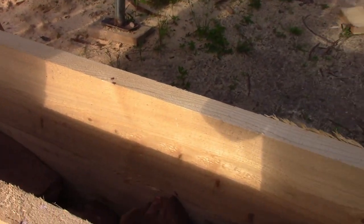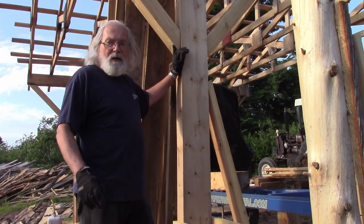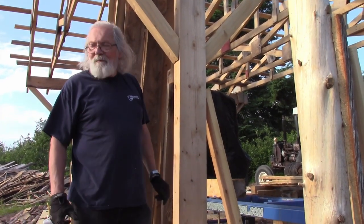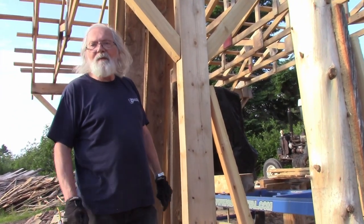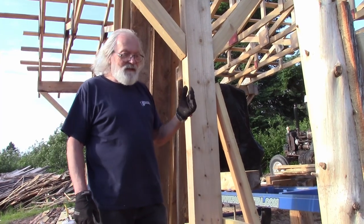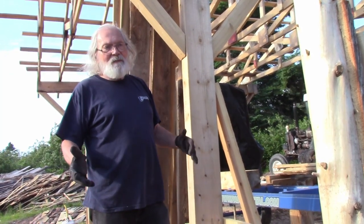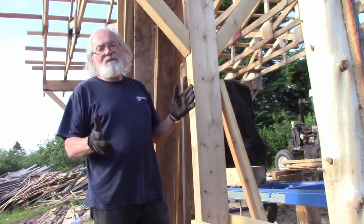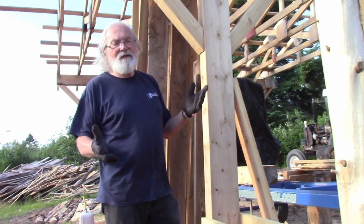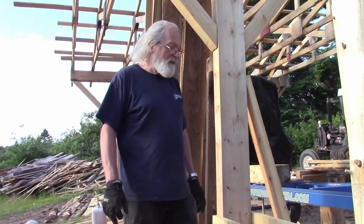And I'll add more, but what I'm doing tonight is I'm going to dump a couple of bags in each wall. Couple bags of what? Of quickcrete. You dump it in and you just water it. Cool. And it won't grow, but it presumably will harden. Sounds good in theory. I've never used it before, and it's more designed for post holes and things like that. So this is a slightly different application, but because we're a fair distance from the house and water source, I'm hoping this will do a half decent job without having to mix it and cart it and use a lot more water than we're going to be using here.